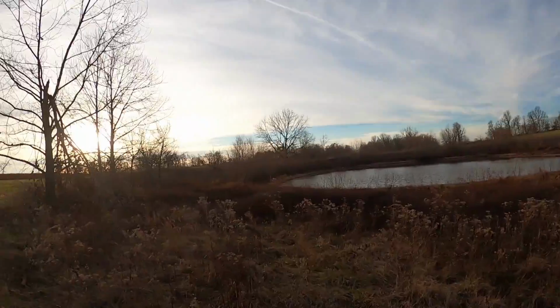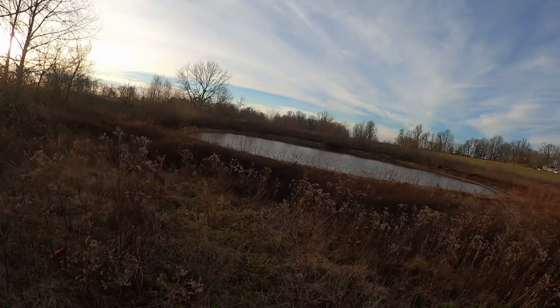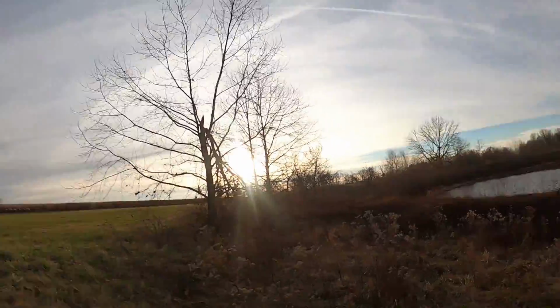Well, again, the situation that we run into is, can we do that? I brought the laser stuff out here, tried to make some shots, but when I was out here, all the vegetation was grown up and you couldn't see squat. Tall weeds and stuff, and the laser wasn't working, couldn't read the beam. So anyway, if we can take the top of the dam down a couple of feet to lessen the slope, because he said the water never gets even close to the top of the dam, then if it's allowable, we're going to take the top of the dam down, put that on the backside, slope that, smooth that out, and hopefully lessen that slope to where he can maintain it.